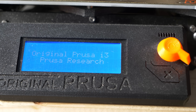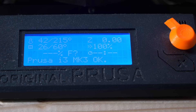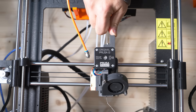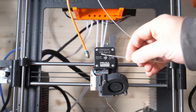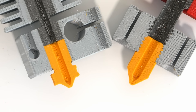At this point, let the temperature go all the way down to room temperature. Once set, reheat the temperature to about 200 degrees and as you are doing so, start pulling on the filament with a bit of force. As the temperature goes higher, you'll notice that at some point the filament is starting to stretch as you're putting tension on it. At this point, give it a good tug. Please note that you should never perform cold pulls on ruby nozzles as you risk severely damaging them. If done successfully, you should hear a popping sound which is the suction within the nozzle. The end of the filament should be shaped like the inside of the nozzle with a microscopic tip representing the nozzle hole — this means you managed to cover the hole inside of the hotend. Doing this a couple of times ensures your nozzle is completely clean.